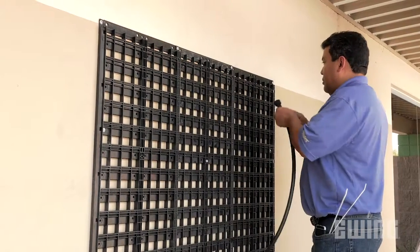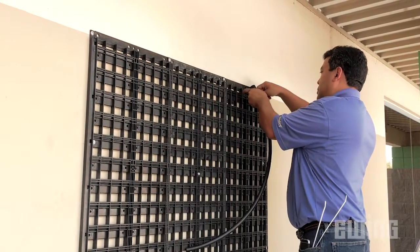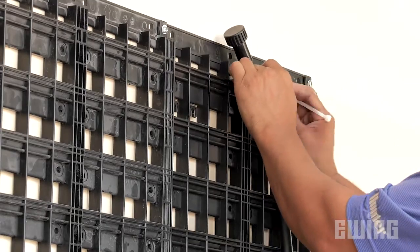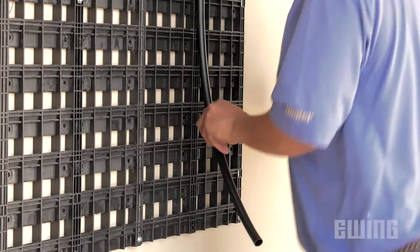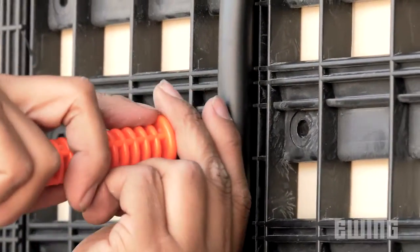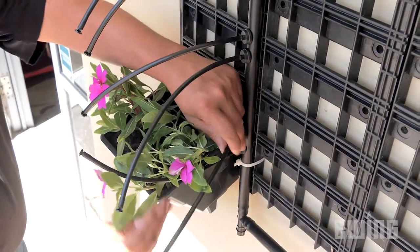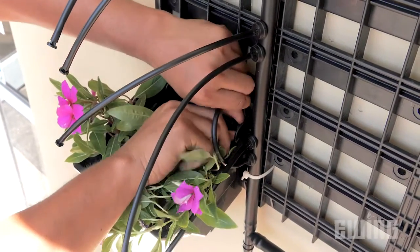With the panels securely attached to the mounting surface, proceed with the installation of the irrigation system. Start by running 1/2 inch or 7/10 polylateral lines vertically between each column of trays. Secure them to the mounting panel with nylon zip ties, then cap off the upper end of each line. Next, attach pressure compensating drip emitters to the lateral lines. Only 1 emitter per tray is required. Finally, run the 1/4 inch distribution tubing from the emitter to the tray using a bug cap at the end.